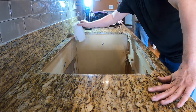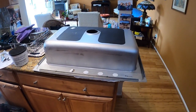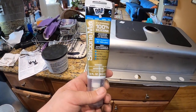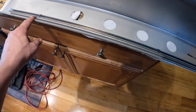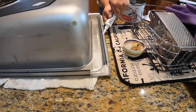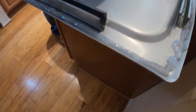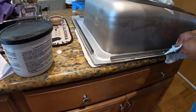Now it's time to clean up the area — we're getting ready to set it down in place. I want to put silicone down so I want to get that area nice and clean. The proper place to put the silicone is on the sink. I've got some DAP silicone sealant that I'm going to apply around the perimeter, right in that groove on that edge, 360 degrees. I like to apply a generous amount — if it spills out a little bit just wipe it up. The silicone also acts as waterproofing so water doesn't go underneath the sink.